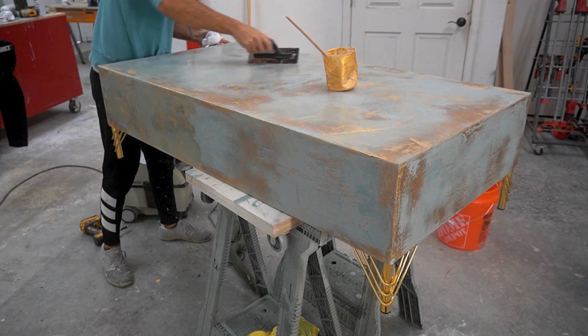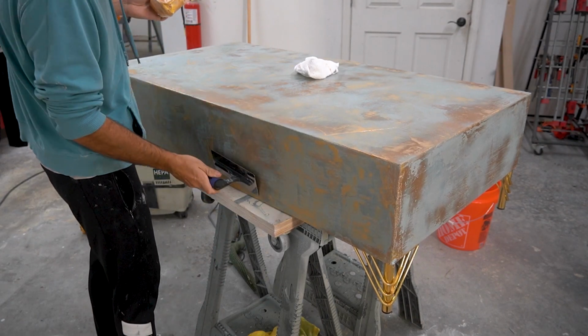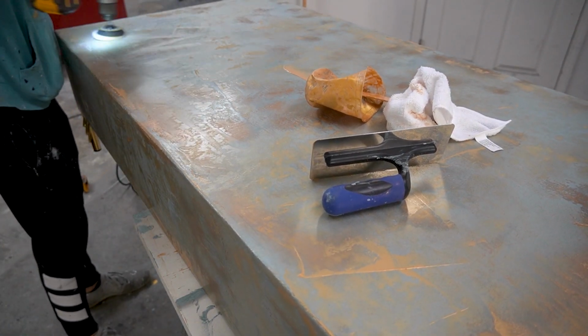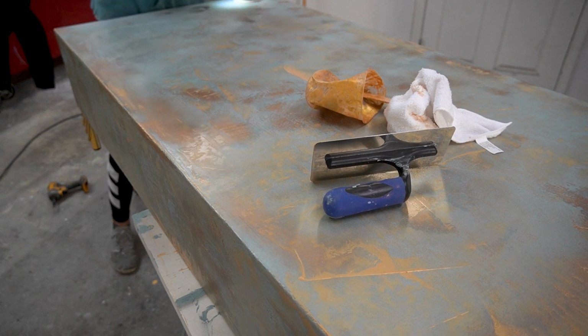And yeah, I was kind of scared for a minute there because I didn't really know what I was going to do about the staining. I actually originally took some pictures of it and was done with this table. But after I saw the staining, I was like, I can't sell this. So yeah, I figured it out. And the lacquer thinner helped a lot. If you try this method, you basically have to wipe the stained areas with some kind of thinner.